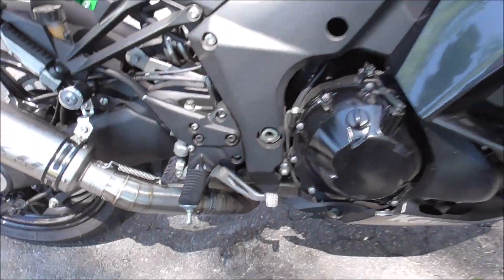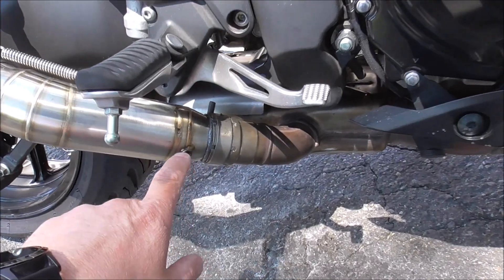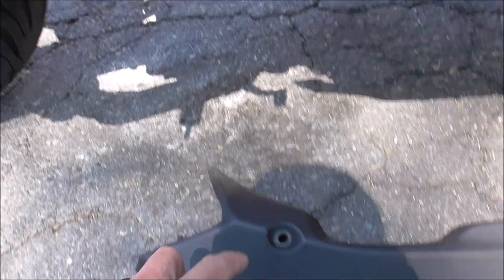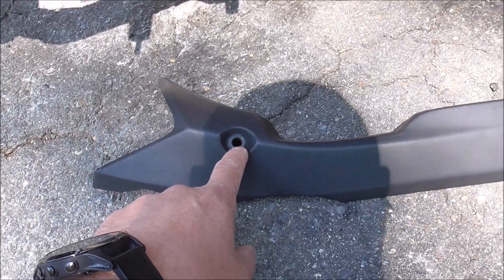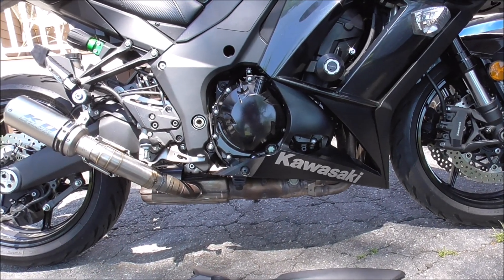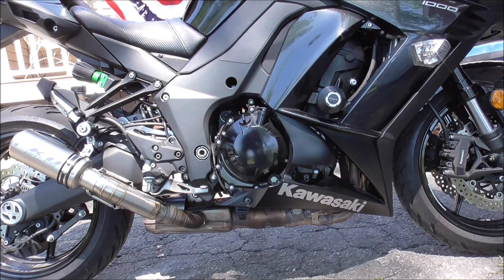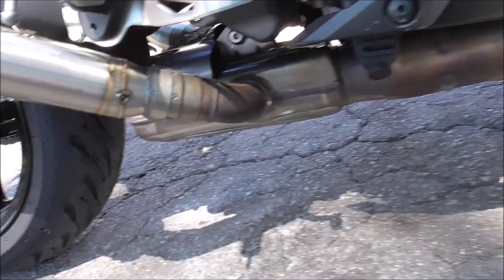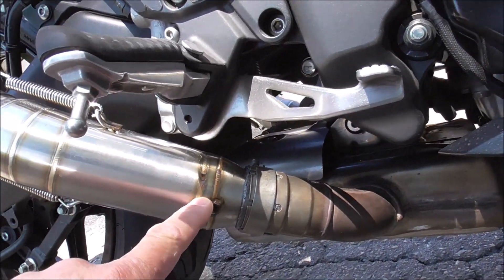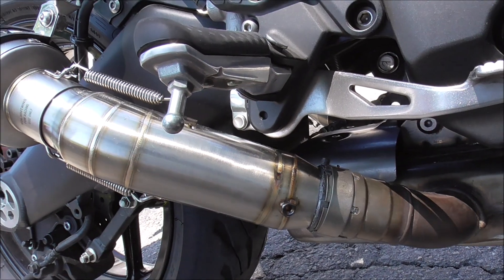So this is what we're working on guys. I just recently replaced the exhaust on this motorcycle and the exhaust came with this little nut that's welded on here, and that's to accept the bolt for this guard. Basically it just kind of covers up all of that area down in there. It doesn't really do anything — it just kind of dresses the bike up. Problem is they didn't weld the nut in the right spot. So we're going to weld a new tab onto this exhaust and because it's stainless we're going to have to TIG weld it.